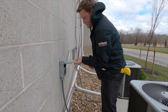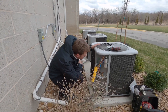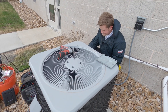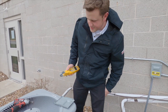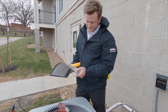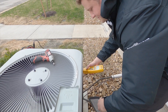These are all pretty tight — that's pretty much all I check. I'll check amperage once I start it back up. Make sure I hooked everything back up before I start — turn it back on. We have 57 amps on startup, so it's starting nice and smooth. LRA is 125, so we're way under that. Running amperage is 9 amps.